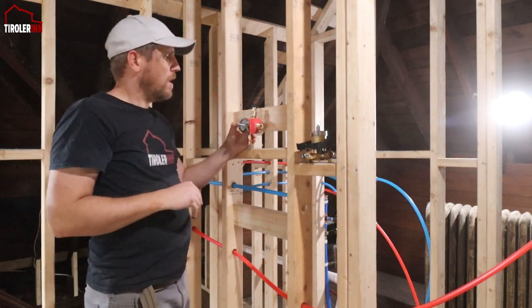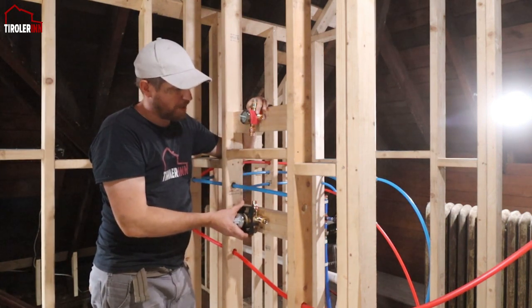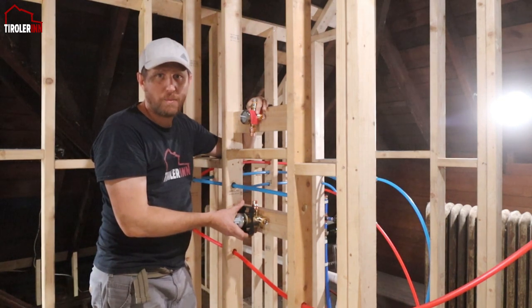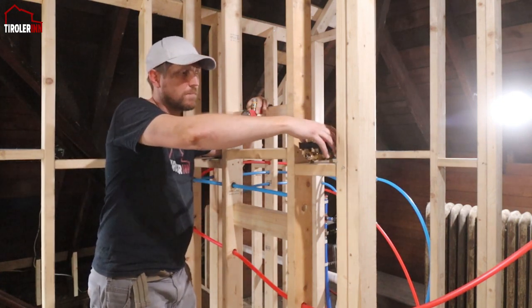Obviously, if you have three outputs, there are more function options, but in this case, I just have three positions for the arm. So we have to install that right above it, and to do that, I am going to solder a small copper piece between the two connections here. I'm doing a copper piece here because it gives me a little bit better flow, especially when both functions are turned on at the same time.